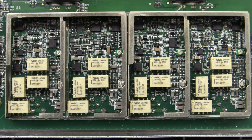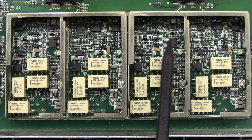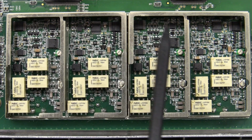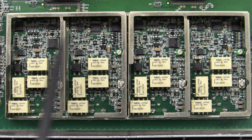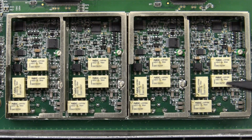And of course, everyone wants to see under the hood of the analog front end, and ta-da! There it is. It looks like we have not 4 identical channels, because look, they're slightly different. And channels, I think this is channel 2 and channel 4 here, have this chip here, slightly different layout. So that'd be a driver. Typically they'll have like a 74HC595 or something like that, just to drive some digital lines and things like that. But otherwise, of course, the analog sections are absolutely identical.